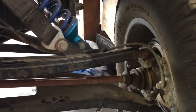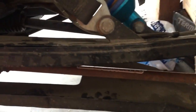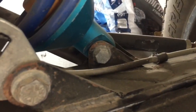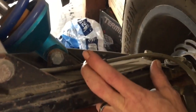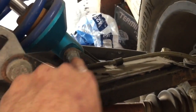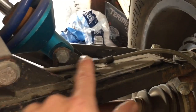I am getting a tube bender, but I don't think I'm going to make these out of tube, because we're just doing the upper and we want to keep it boxy looking. The big issue here was obviously they didn't spread the load of this shock mount when they added three inches with long travel, and it just buckled. So when I build my shock mount, I'm definitely going to spread the load as far as I can.